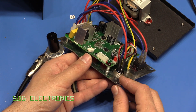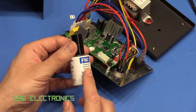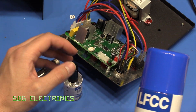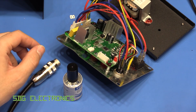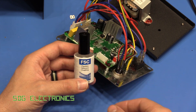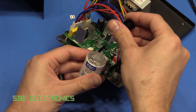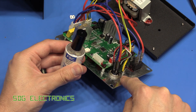So even with the heat shrink on there I wasn't really happy. This video is just a quick recommendation for getting some of this stuff. It's basically a conformal coating that you can buy in an aerosol can, but the great thing is that if you're trying to do this you'd end up spraying half the board and all of your desk and everything. This stuff allows you to be really precise with your application — it comes in this nail varnish type container and just has a little brush, and in this case I was just able to drip it down the wires so that it got really in there.